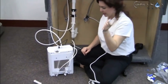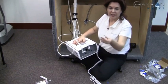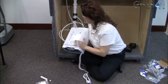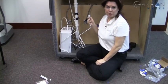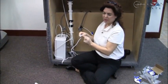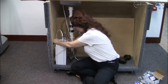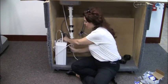The last thing we have to do is plug in the ionizer. The cord goes underneath and has an interesting shape — part of it is flat — and you're going to line it up with the corresponding shape and plug it in. Set it underneath your sink. Use a power strip with a surge protector to plug this in if you don't have enough plugs. This is a grounded three-pronged cord. Nothing is going to work until you plug it in and turn your cold water line back on. You can manage your cords to make it a little neater when you're done.